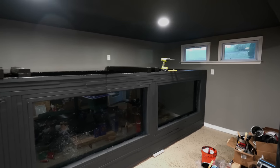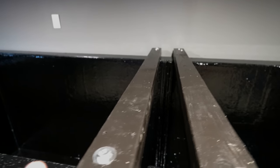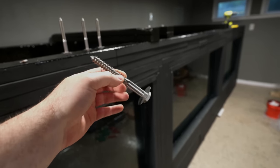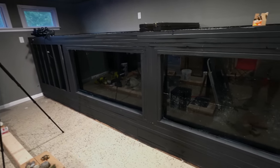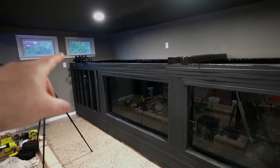This is a big milestone — all the bracing is in place to do the test fill. We've got essentially four-by-four braces lag-bolted into the top, with space for the dividers, evenly spaced even where there's no divider. Those big lag bolts are keeping everything locked in. That means we can test fill this thing. I'll add the hose to the wetland filter area, let that fill up and cascade over, keep an eye on everything, and hopefully not see any water out here on the floor.